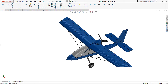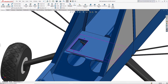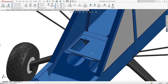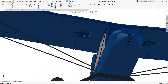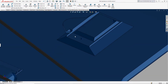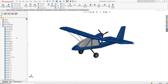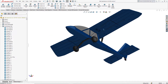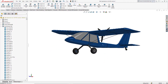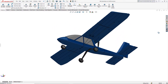I've optimized the design to be printed in a material called LW PLA or lightweight PLA from a company called ColorFab, which is incredibly lightweight but has more flexibility. So I found it necessary to design separate servo trays that I'll print out of standard PLA — one for the elevator and rudder servos in the fuselage, and a servo tray for each aileron servo. I also wanted builders to have options with landing gear, so I designed different slots into the fuselage for a tail dragger with larger backcountry tires or a tricycle gear configuration.